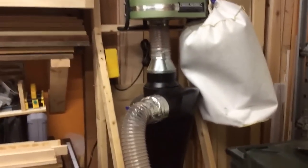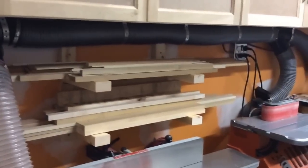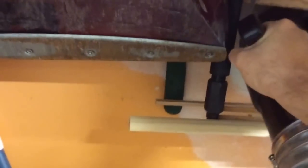I've seen your shop John - it's not huge. You may want to put in a couple of places where you have just a short run of pipe and a couple of blast gates. This one over here is maybe max eight feet and this flexible run of pipe maybe six feet, and this little Harbor Freight blower does just fine pulling all the dust over those short distances. I've never seen a degradation in performance.